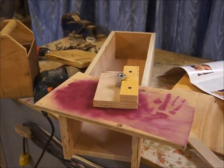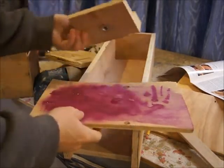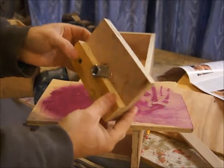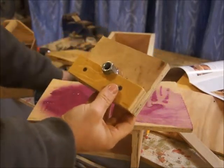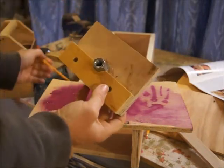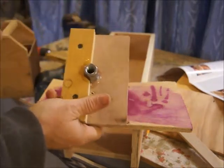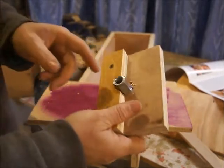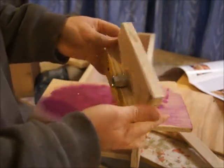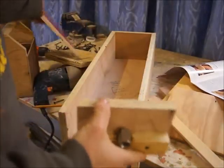Here is what we're doing right now. We've got this piece right here — we've made it, the epoxy is leaking through on the bottom just a little bit around here. We put the epoxy on less than five minutes ago and as you can see it's all starting to set in, it's getting hard already. Epoxy is wonderful stuff. I use five-minute epoxy a lot in the shop. One of the things about epoxy is it'll bond between metal and wood — it's one of the few things that will — and it'll make a tight bond to both. So that's what's going to hold that in there and hold the screw.